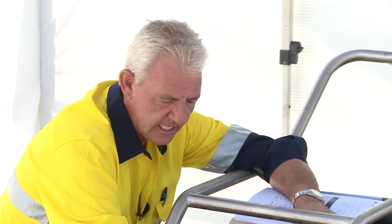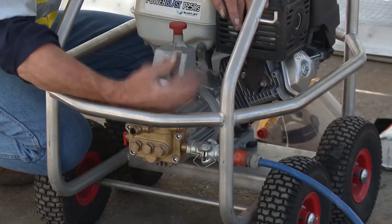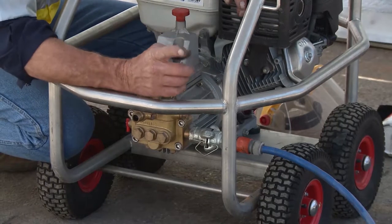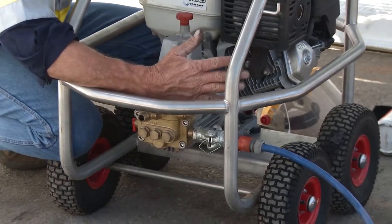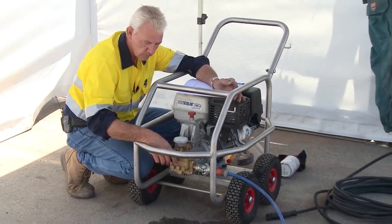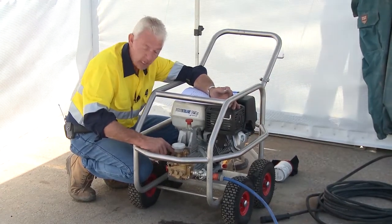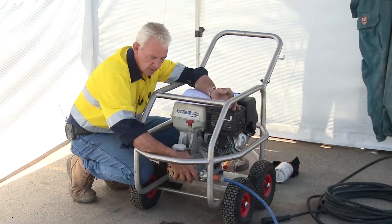With this particular pump, we need a good water flow, primarily because the output is a set number of litres per minute. Every manufacturer states a maximum psi and maximum litres per minute. Without a reservoir, if somebody ran over the supply hose and pinched the water, the pump continues to generate but starts to starve of liquid. The fluidity within the pump is reduced to such a degree that it becomes detrimental — it'll actually cook the pump.